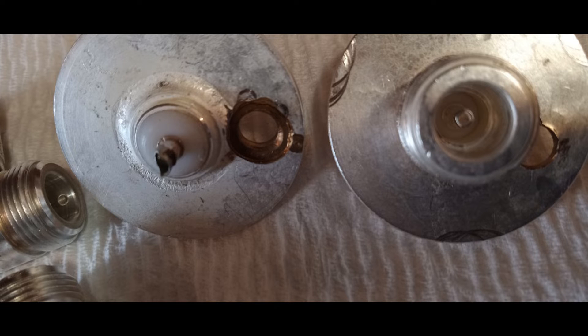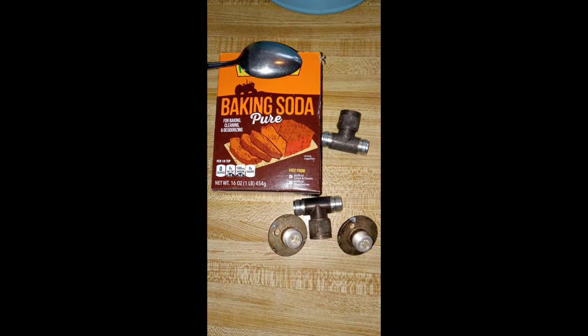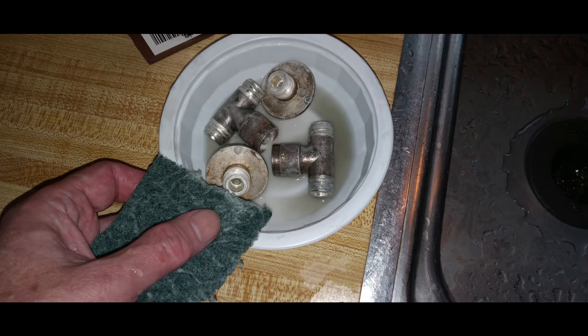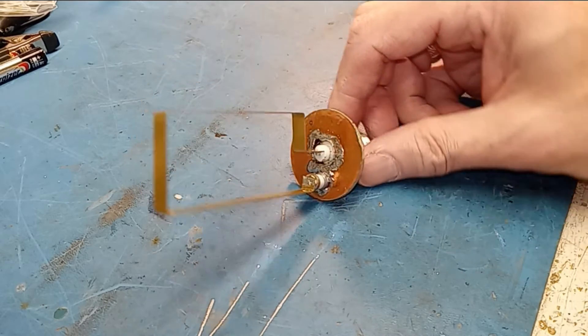After drilling, the bases and end connectors were cleaned with baking soda and water to remove the oxidation and shine up the silver. After cleaning, the capacitors were mounted and then placed in the alignment jig, and the coupling loops were reattached back to the capacitor and the end connector.